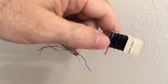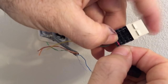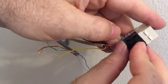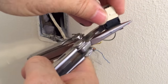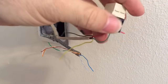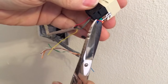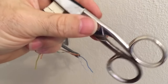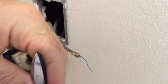If you don't have a punch tool — most people who don't do this all the time don't have one — you can push the wires into the slots as much as you can with your fingernails. Then put the cap on, take a pair of pliers, and cinch down on the cap. That'll push the wire down where it needs to go. When done, trim the excess wires with snips — special telecom scissors available at big box stores or linked in the description.